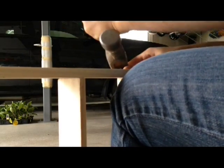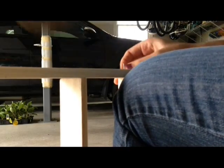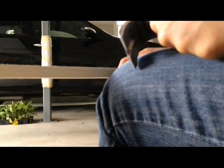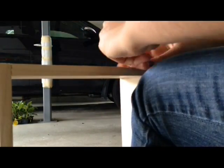The thickness of the nails was a big part of this — I had to make sure they weren't too thick, otherwise they would splinter the wood, since each shelf is 3/8 of an inch thick. I also didn't want the nails to be too long because that could also cause splintering. And if I wasn't able to hammer the nail in at exactly 90 degrees, it would have a more obvious effect and the nail would definitely stick out. By using a nail that's one inch long, even if I was a little off, it didn't matter because the nail wasn't long enough to go through the shelf.